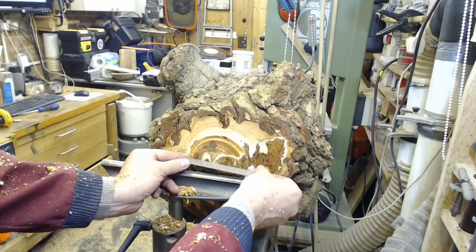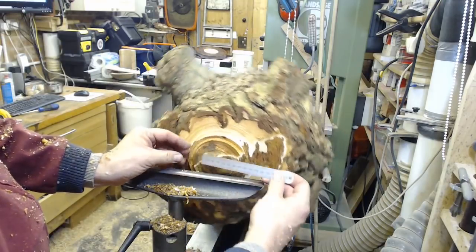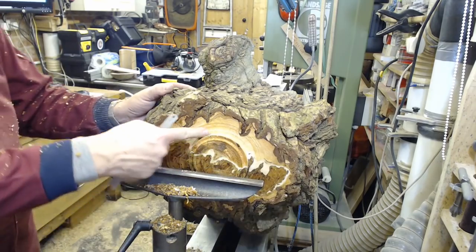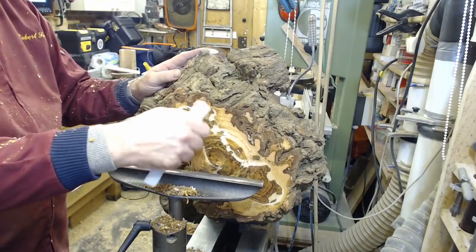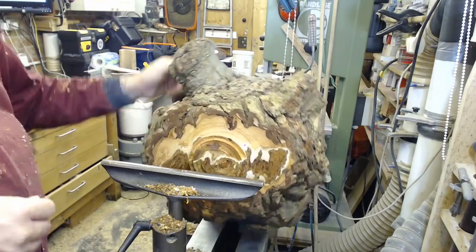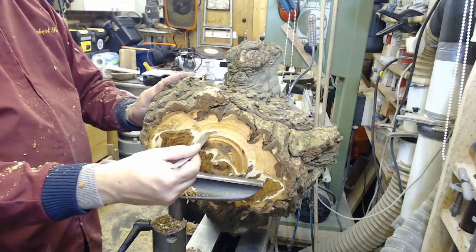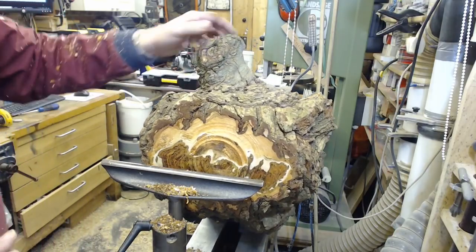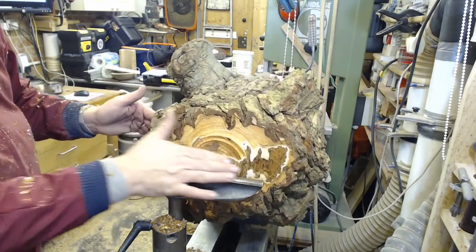I want the foot to have the best grain possible, so that means getting it as close to a hundred as possible — that's about a hundred and six. Where it was soft around here before, that's gone. That's pretty solid wood, although very wet because it's freshly felled. In terms of the depth I've got here, that's 15 millimetres to that point. So I can shave a couple of millimetres off, dovetail it and then flatten off this part.